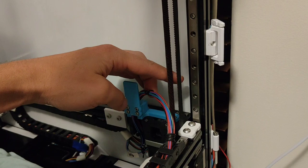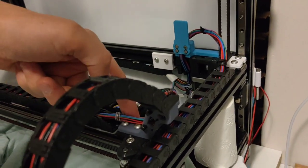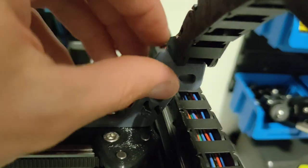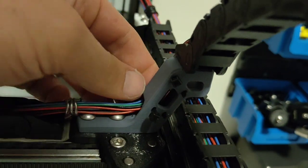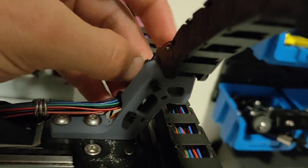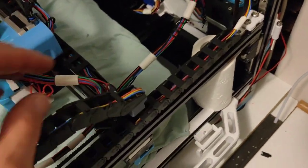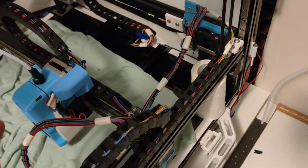Now we got this on the inside of this belt. I am going to undo the chain and separate the cable that runs here and then have this cable loose, dangling in the middle. So I'm gonna pop out all the little pins. That I never did on my machine was close up all my cable ties. They're just loose, so I can just pull them out. There we go. Just the heat from the machine, they hold their shape and their position, see? So the first half is done. I've got the cable out and separated for the optical sensor running down here, so that still runs in here.